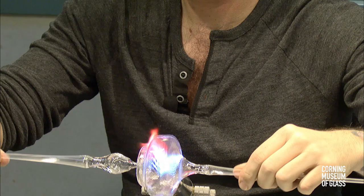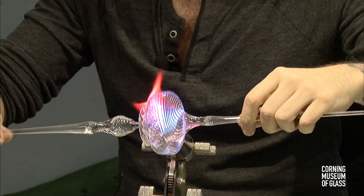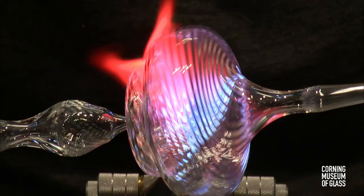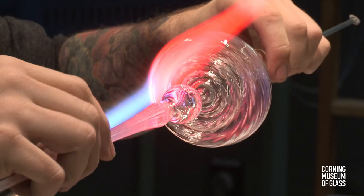It also makes a bit more of a pleasing shape. Kind of more of a contour. When I make my next demo, the yo-yo, that will become more apparent. The last layer. Heating the sidewall. Starts to push inward, transition the heat to the outer wall. Just try to feed some of that outer wall glass to the interior of that push.